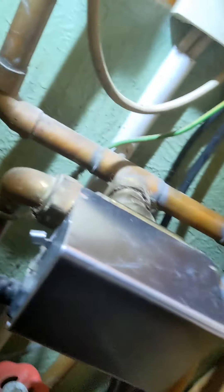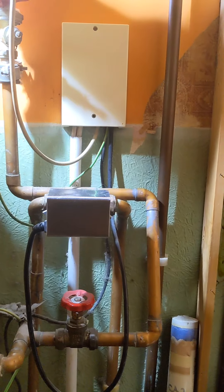That's up to maximum. Let's see if that zone valve is motoring over. We still haven't got any demand here - no, same result. So I'm going to whip this head off and test the motor and test the spindle on this three-port.